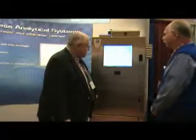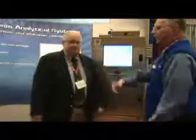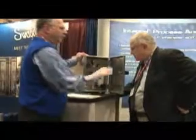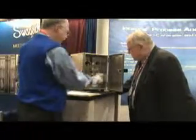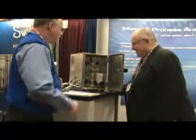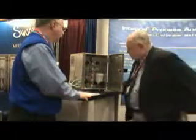It's actually quite reasonable when you think of the ability to do things online and make real-time or near real-time decisions and control processes. The system is available now. The other part is the sample prep system over here — the sample prep functionality for doing online sampling, dilutions, concentration, and so on. This can be interfaced to a lab LC in a controlled environment, so you can start gathering process information early during process development — enabling PAT in the lab environment, which is a huge advantage when you want to get deeper process understanding as early as possible.